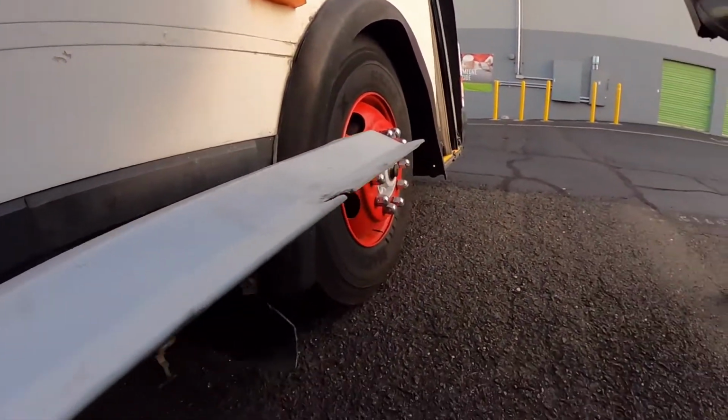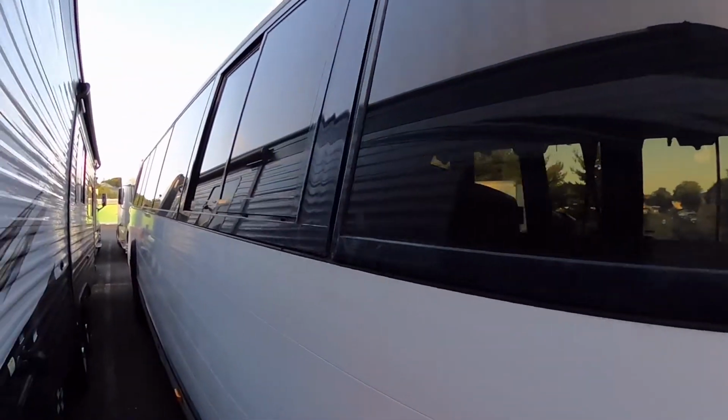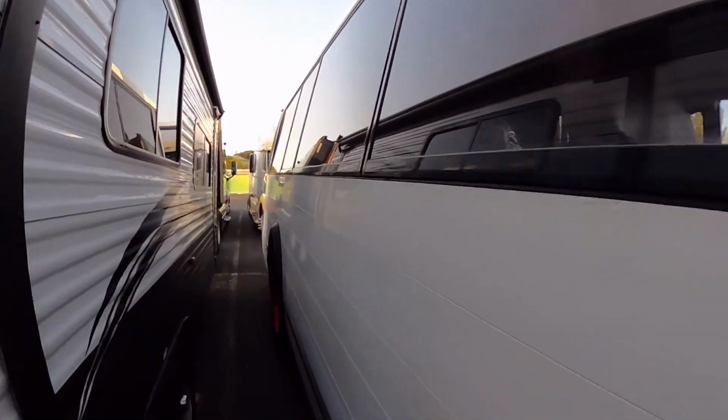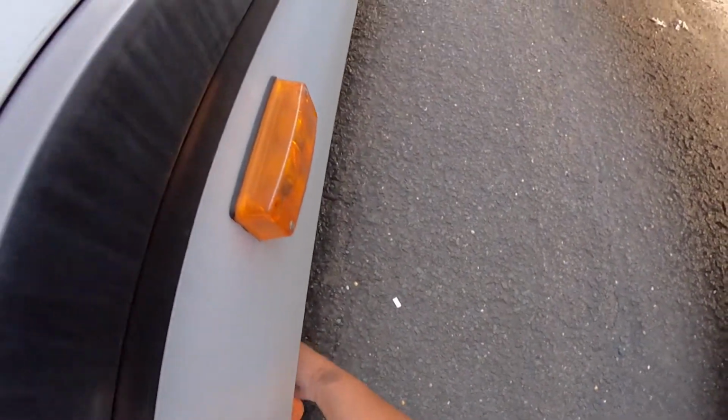Now, as you do this, as you can see with Mary, the bus will start to settle. So that's what I'm saying about safety first. You got to also know your bus. Older buses, the leveling valves and your check valves are not as good as when they were in service. So it will start leaning until you change them, like anything. When you change your leveling valves, your check valves, it'll stop doing the gangster lean. But like anything, it requires time and money, and not everybody has both. So right here you got your fuel tank. So yeah, this is your last one.